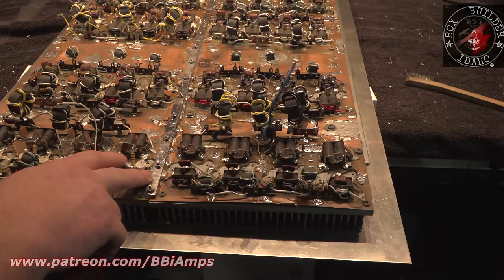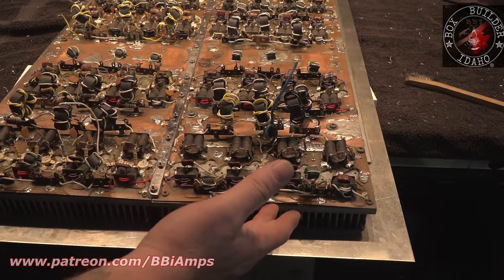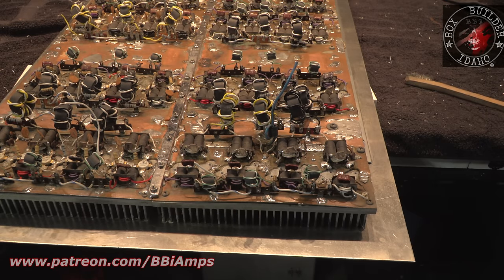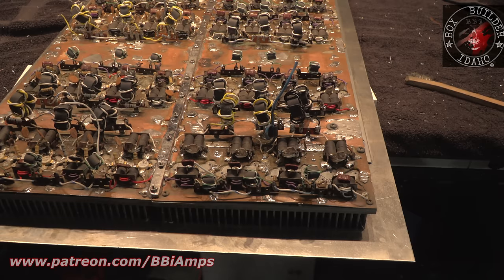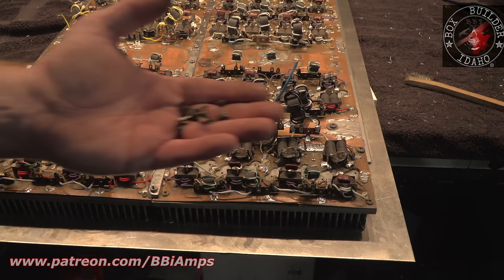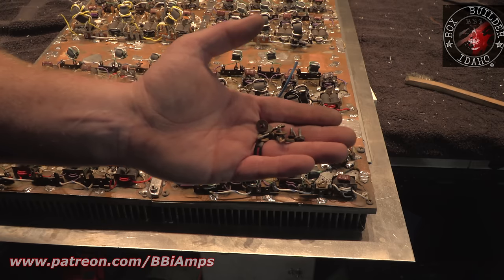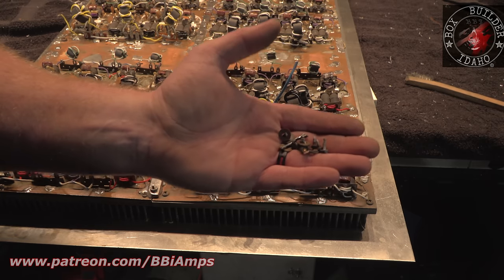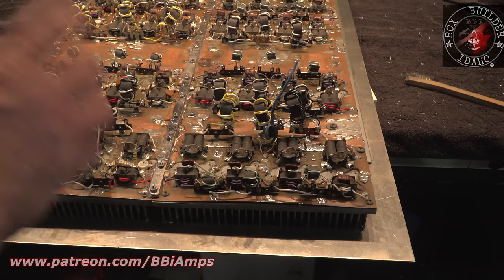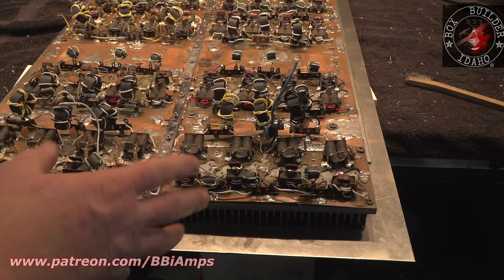We had no ground, no ground. This wasn't grounded. Couple little rusted sheet metal screws, like these here, going through aluminum, through galvanized. This is literally half of the screws that were holding the whole amp in place. These six little screws are all rusted and gross. The electron pixies who are somehow magically making it to these transistors are literally put in the worst possible environment that they could have to work.